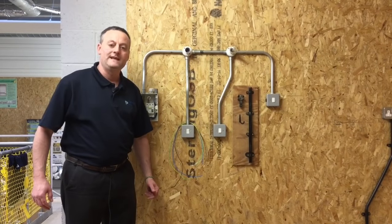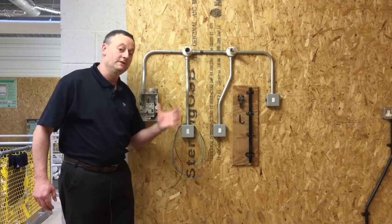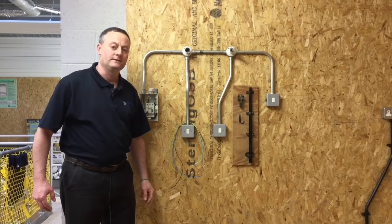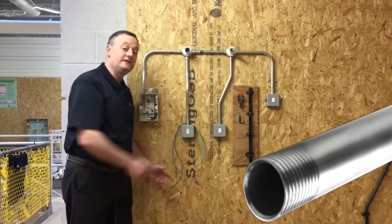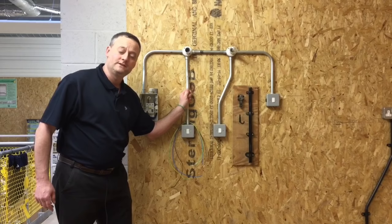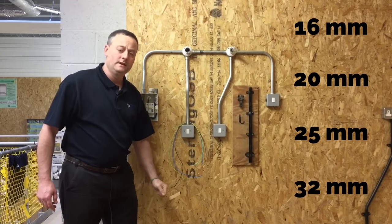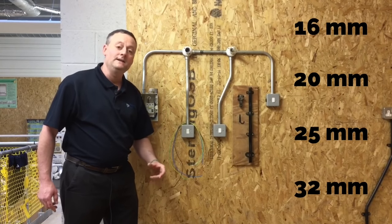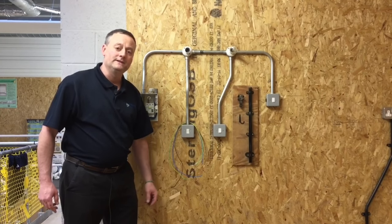In this video presentation I'm going to recap some of the learning we picked up during our conduit exercises. We started our conduit lighting circuit and the conduit itself is steel. Steel conduit, the same as plastic conduit, comes in four standard sizes: 16mm, 20mm, 25mm, and 32mm — that's the diameter of the conduit itself, not millimeters squared.